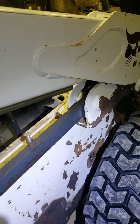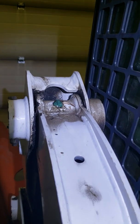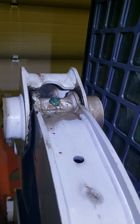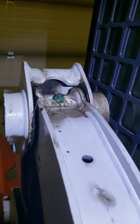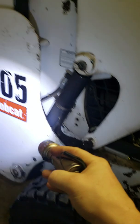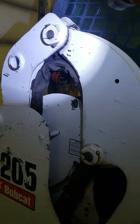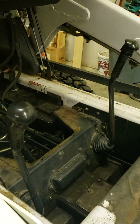So that's top and bottom of that ram. You've got both ends of that arm, and up top there's a pivot point — anywhere this thing pivots there's going to be a grease nipple. They all should be greased regularly. They say every 10 hours; I try to do mine every five or six hours, basically every day if it gets used well. So to summarize: three on the bucket, one on each side of the bottom arm, top and bottom of the ram, the back point, the top point, and your pivot shaft for steering. Now you haven't missed anything.